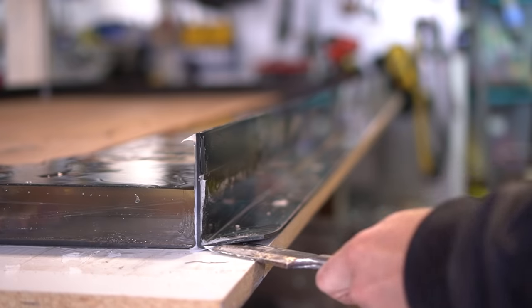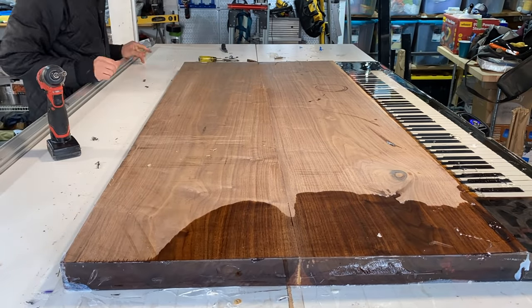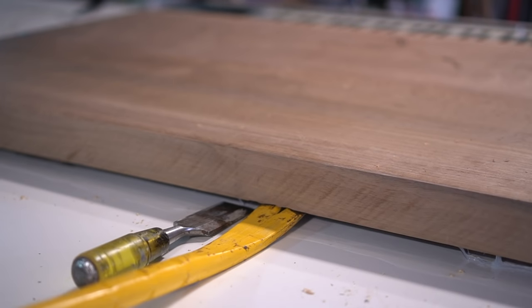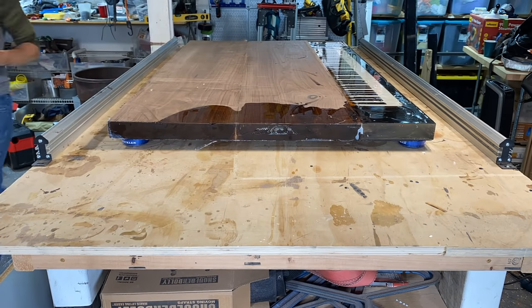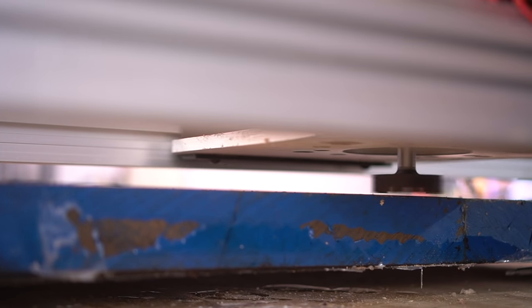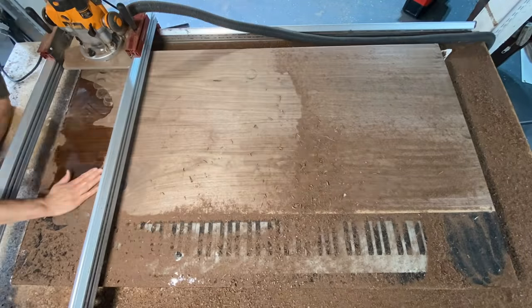I start removing all the side panels of the form and trying to get underneath the large slab. A large crowbar does wonders — just be careful not to damage the bottom side of the wood. For flattening, the best solution I have is my router sled from Woodpeckers. I know not everyone has this system since it's expensive. If you're interested in building your own, I did a video on how to create a $20 router sled — check the link above. The beauty of this system is that you can get things extremely flat, very easily and fairly quickly.